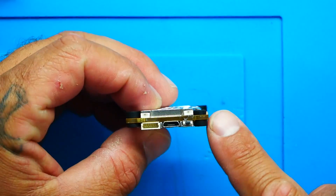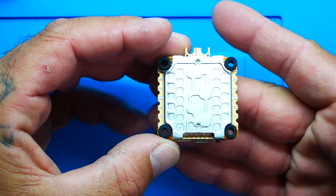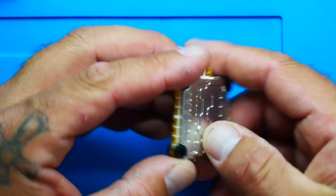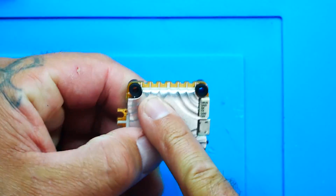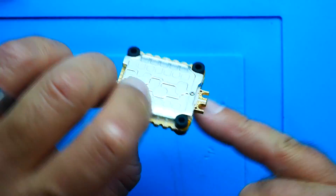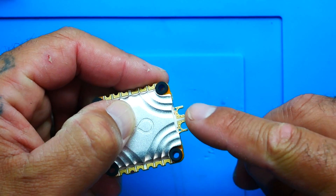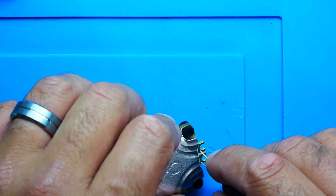I can see here that it's a micro USB, not a USB-C. We've got the MPU that we talked about. I did notice around the edge — this is probably the flight controller side and this is the ESC side — not that it really matters because the pads you have to solder up your motors are on both sides. Your XT60 is on both sides.